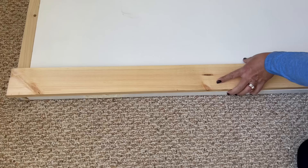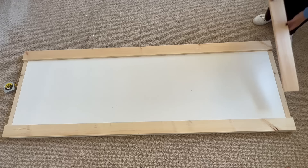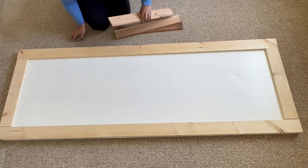I attached the wood to the door using liquid nails, being careful to move the wood into place from the outside so that I didn't get the liquid adhesive onto the surface of the door that would be visible. I love how the one by four covers up that old door handle space. For the horizontal pieces I again measured and cut — take time to make sure everything is spaced perfectly.